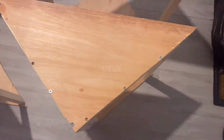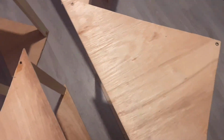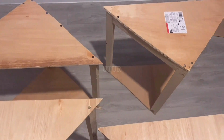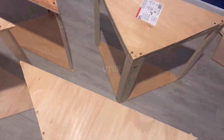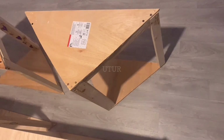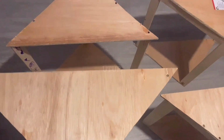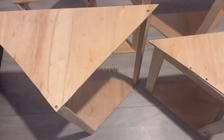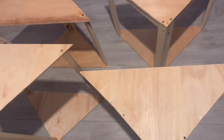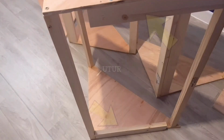And you can see, just by visually inspecting the screw heads that have been used to tighten the hardwood plywood sectionally or diagonally cut boards onto the housing frame, that they have different colors. That's because some screws are shorter than the 4mm in diameter and 60mm in length screw that was used initially to couple the pine wood together. And like I said, the plywood is only about 9mm thick, so I definitely needed shorter screws to couple it onto the pine wood structure, and so I used shorter screws, okay? It saves the pine wood from splintering and driving the screws further in when you don't need to.